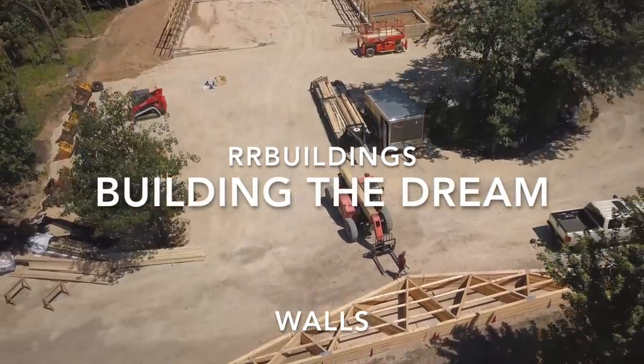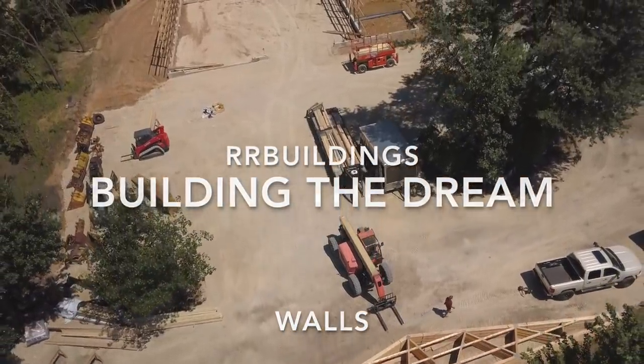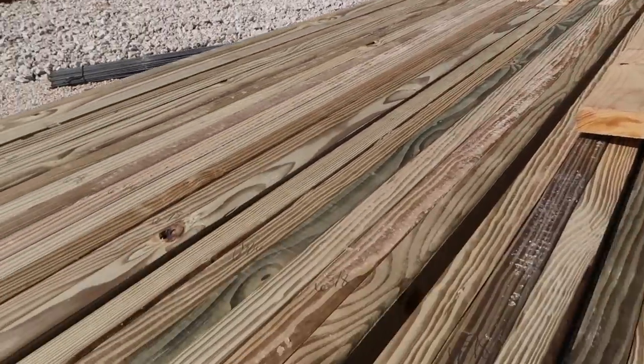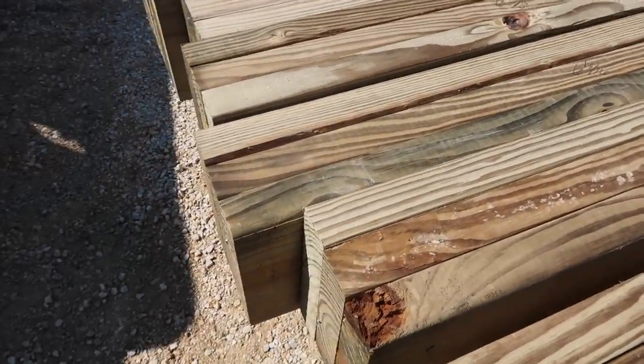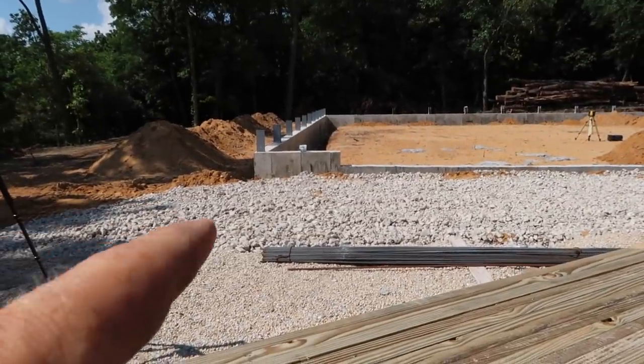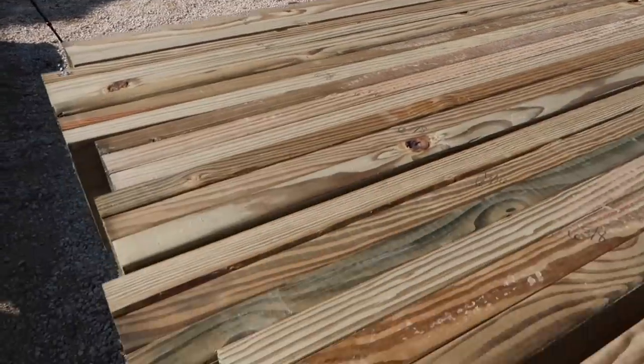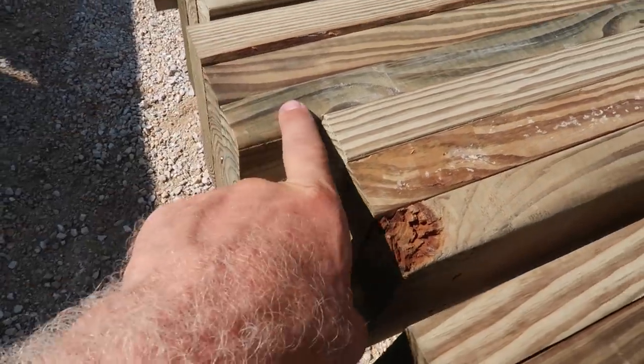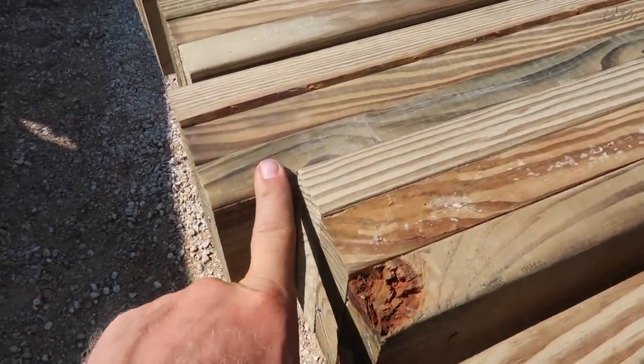My name's Kyle, and I'm going to take you through the steps of framing the walls today. So we're getting our story pole set up, and I know you guys have seen us do that before, but what's a little bit different on this one is since our wall sticks up 6 inches, usually we add to the bottom of the grade board, whatever that difference is in our brackets. We're actually going to subtract that now.